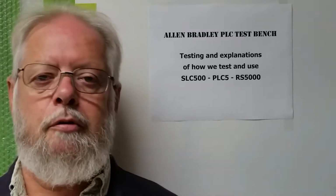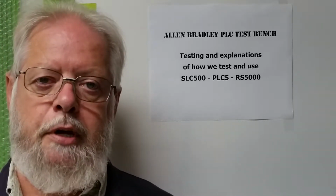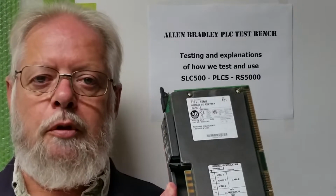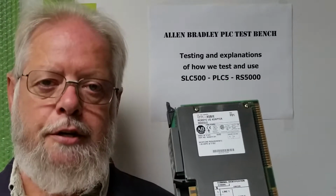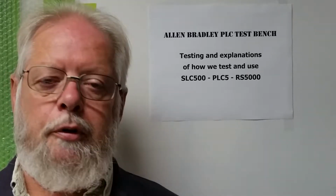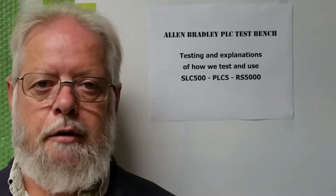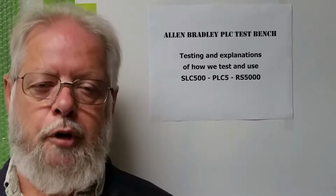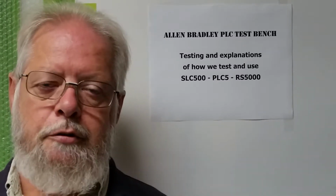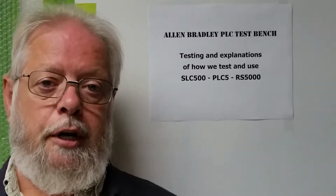Today we're going to be going through the Allen Bradley 1771 ASB. This is the original remote I/O module for communicating to remote chassis in the 1771 series. Nowadays people are ripping these out, and ripping out the chassis, and putting in Flex I/O with ASBs, or putting in ControlLogix racks with ENBTs or EN2Ts or EN3TRs or something like that for Ethernet communication.